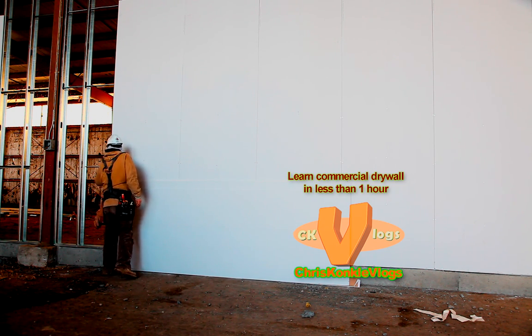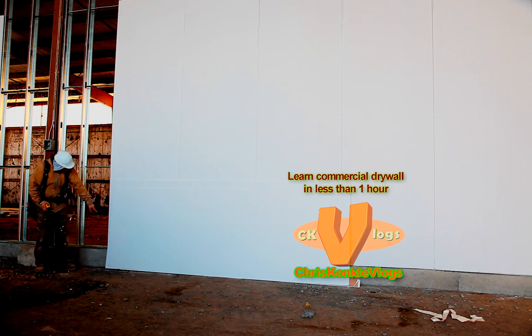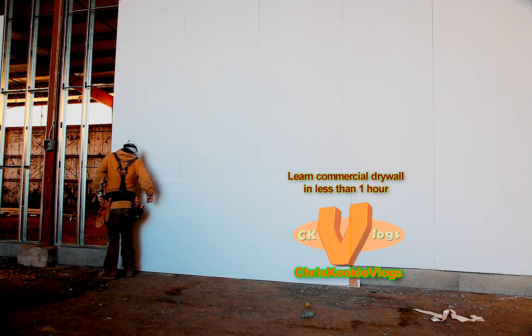Alright, so our sheet has a cut at the bottom. I have it already marked down, 42.5 and up an inch. Remember, it's going to be a half inch off the ground, so we got to account for that in our bottom up measurement. Right over 42.5. Right there. Up 1 inch, bottom up. A little tiny piece out of the corner like that. Take your drywall saw, simple as that. Voila.